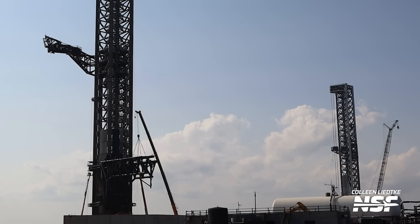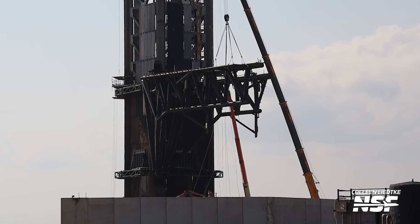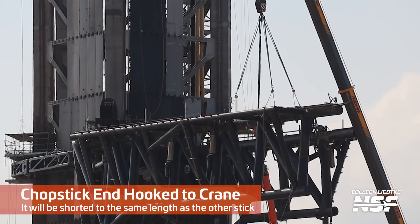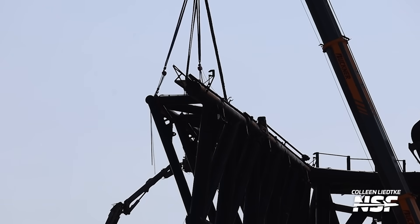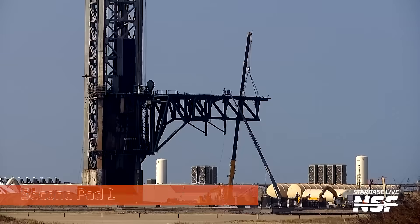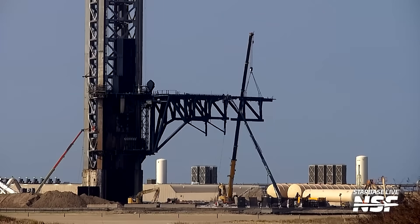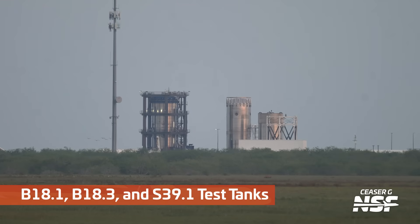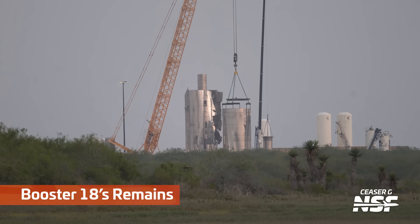Little wide shot of the launch site — Pad 1 on the left-hand side, Pad 2 on the right-hand side. The chopsticks aren't the same length — still one shorty chopstick and one longer chopstick. The chopstick closer to you is hooked up to the crane with all the weights and balances figured out. What they're going to do is lop off those tubes — cut off the end of the chopsticks so they can move a little bit more quickly. It's shorter so it can be more quickly and more accurately moved — it doesn't have that big moment of inertia when it's longer. Cut it down because they don't need that extra length, and they can just do it more accurately and more quickly.